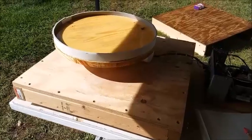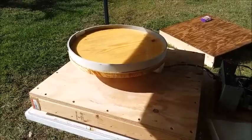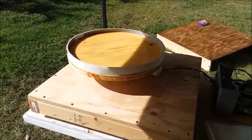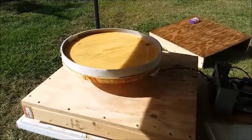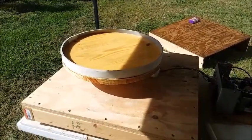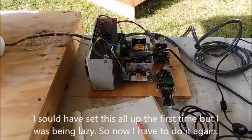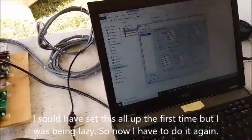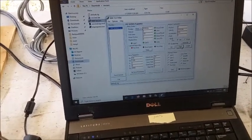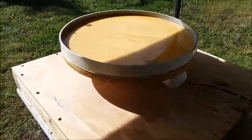I got it level, got the turntable on it, and this time things are going to be a little different. I was running the turntable open loop before and wasn't really doing a great job of timing the rotation rate, so I wound up with the turntable going a little slow and not getting the curve I wanted. This time I've got a servo controller out here run by the computer, and it's turning at exactly the rate I want — I've checked it seven ways to Sunday.